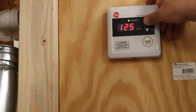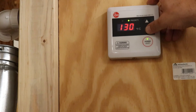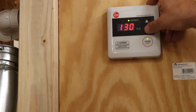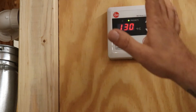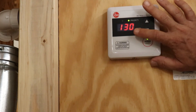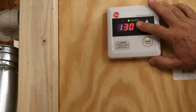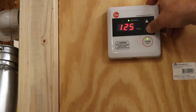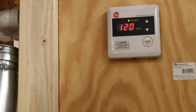You can go up to 120, 125, 130, and 140. Although, I would play around with 125 first. You don't really want to get to any of these higher temperatures — I just don't recommend it. It takes away from some of the efficiency of the water heater and you're having to back off a little bit in your showers. Now, some people like to have the 130 because that's where it kills germs and things like that — some of the people that have the CPAPs and stuff with the apnea, they want to run their hot water and clean those masks at 130. People have asked that. But you can go up and you can go back down. It's pretty simple — Rinnai's easy to work with.